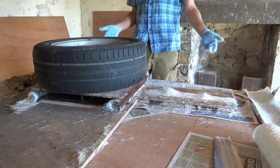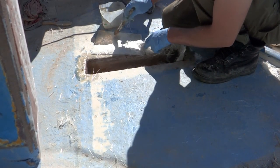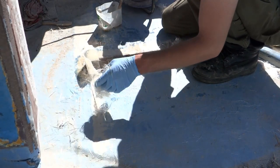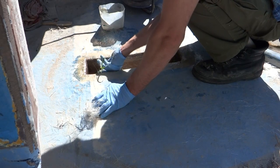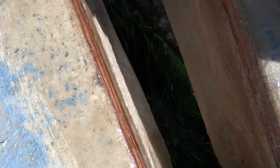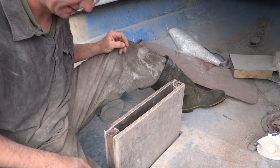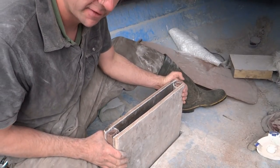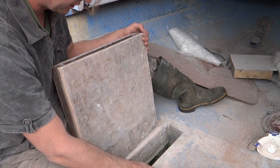Let's go. Very nice — most of the bubbles are out. Next time I'll bring the box in, cut the hole a bit bigger, and then start waterproofing the inside of the box and it'll be good. Very nice. Fiberglass is lovely. I'm starting to feel a bit less crazy now. I have a hole in my boat — I've resealed the floatation in the deck and made a box. The box is coming together nicely.